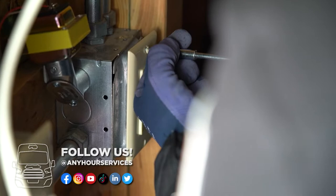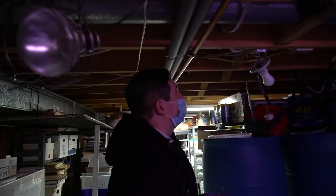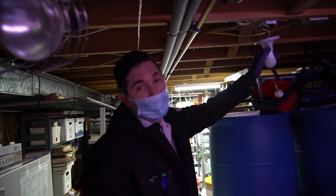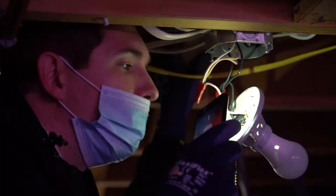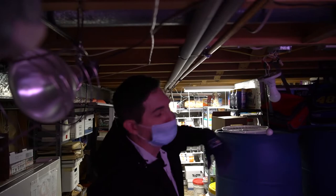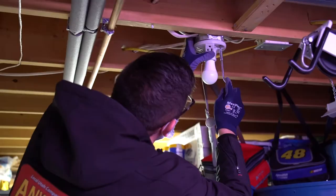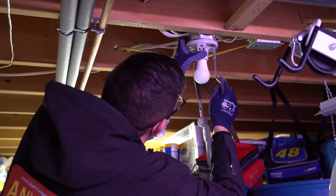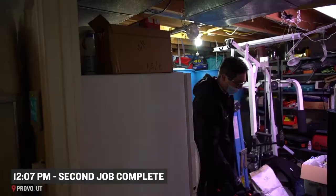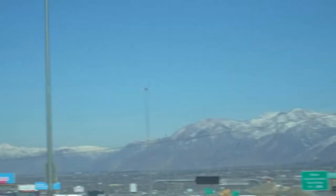We'll put a new plate on since the old one is broke. The customer mentioned he plugged something into a different type of fixture and had a big spark — kind of an explosion — so we want to take a look at what may have caused that. The outlet is not actually grounded, so we're going to extend the wire so that the outlet will be properly grounded for safety. We finished up — installed the doorbell transformer and wiring for the back shed, and took care of the light fixture issue in the basement.